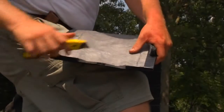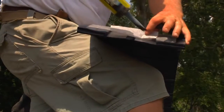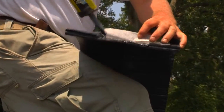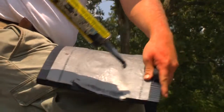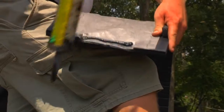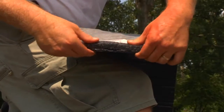Using a utility knife, make a cut into the storm stop membrane, 1/2 inch on each side, back from the end of the section. Using sealant caulk, coat the plastic part under the storm stop membrane that has been slit. Using sealant caulk, coat storm stop membrane on the top side. Insert foam end cap with cut back storm stop membrane between foam end cap and the underside of the vent to ensure a weather-tight seal.